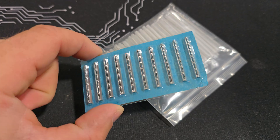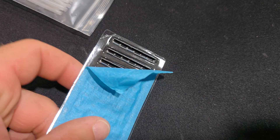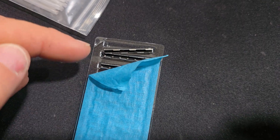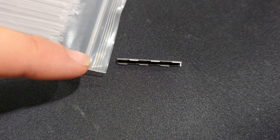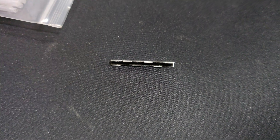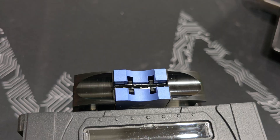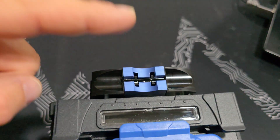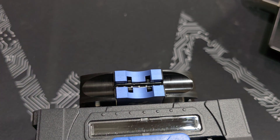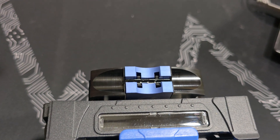Here's a close-up look at the crimp sleeves. Opening up the package — here's a better view. That's the open part of the crimp sleeve, and on the bottom there's the open part as well. It looks like it has little pads on the inside that help protect the splice when it crimps down. This is what it looks like when you have it in the tool. You take the fiber from where it's been spliced, place it in here, then press down and it crimps over the fiber.